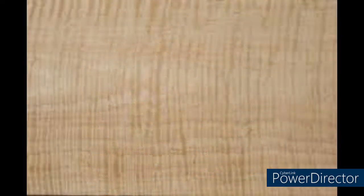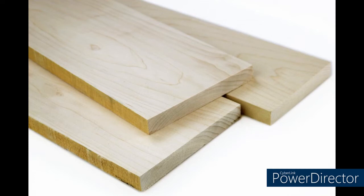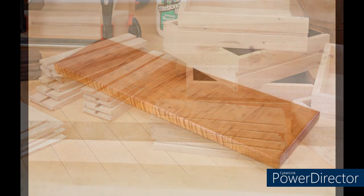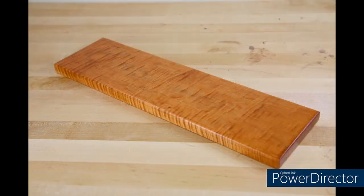In the no curl sort stocked here at Aetna, the heavy figured material such as bird's eye or curl is taken out so that a more consistent product can be produced. This helps for applications where consistency is key — for example, drawer sides where glue lines want to be hidden, or millwork where a light finish is going to be used and curl will come through.